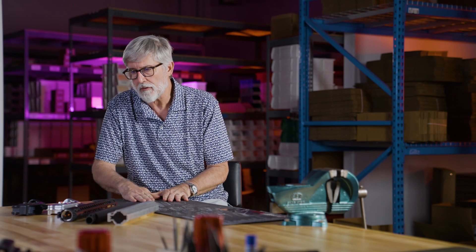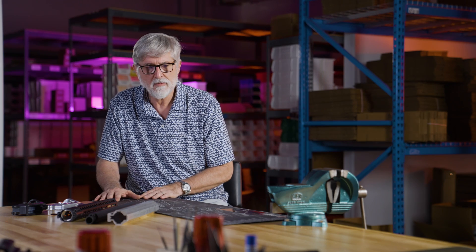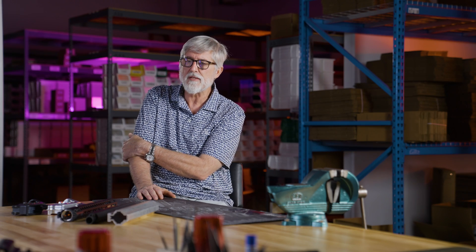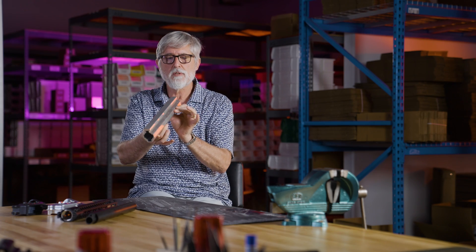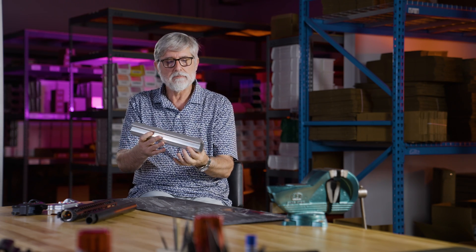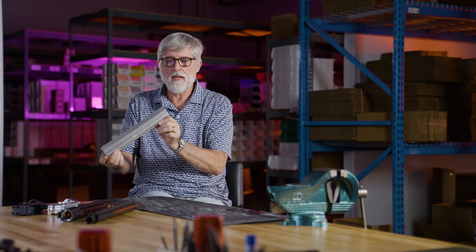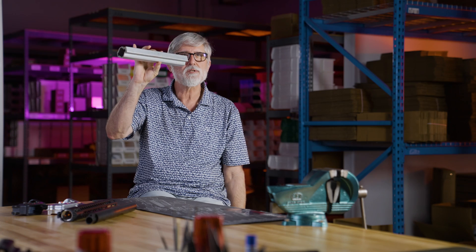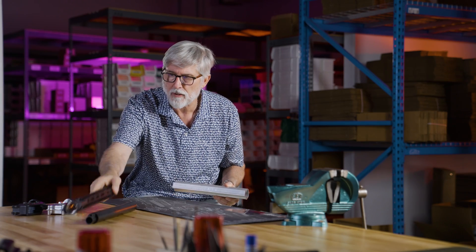We have three different types of hand guards. We started off with the wedge lock, which was quickly adopted by other folks that we licensed the design to. That was my first attempt at a hand guard and I'm super proud of it. We initially did it in aluminum-lithium, and then all of the Hodge defense wedge lock hand guards were done out of 7075. This is an extrusion — basically a Play-Doh press in a way. You take material, shove it through a shape, and this is what's called a seamless hollow extrusion. It comes out of a machine just like this, so we have a near-net shape of the hand guard. We'll fixture it up and cut the rest of it to where it looks like this.